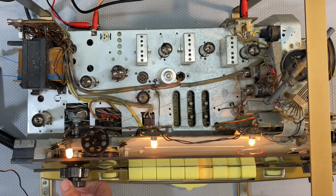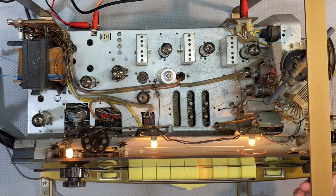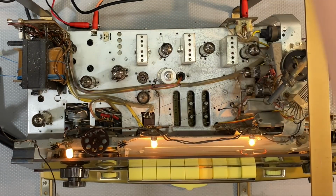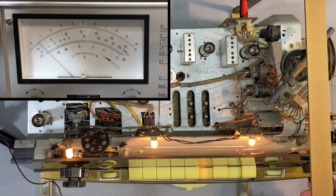I don't hear anything. I'm going to tune to about 7.1. I hear bugger all. Oh, here we go. It's actually closer to 7 than 7.1. So let's see, is it 7.1? This marking on here is actually 7.2, I'm sure of it. Let me just check on the 125. Yeah, it says 7.1, but I'm sure that the marking is at 7.2, so I'm going to put it on 7.2. So 7.2, let's see where this is. It's slightly off. So what I'm going to do is move it to 7.2 exactly.